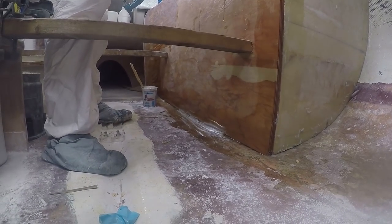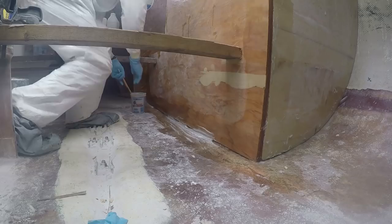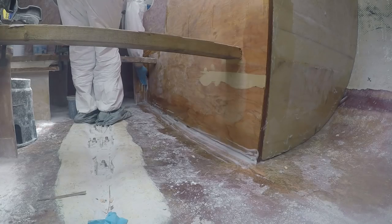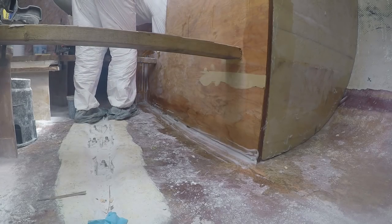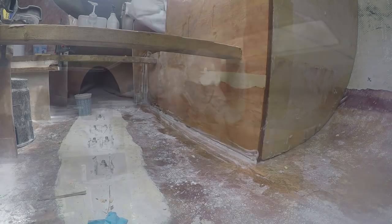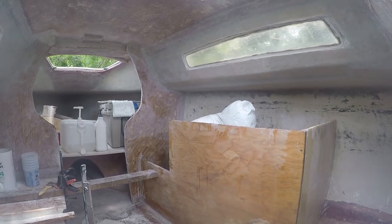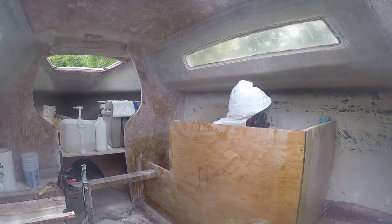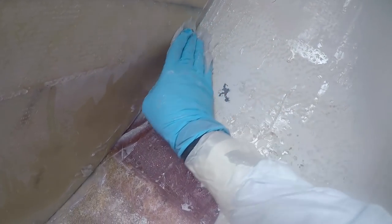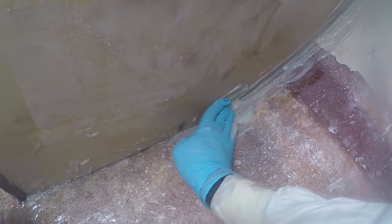The smudge is fixed — we can see again. As with all added pieces to the boat, I start with thickened epoxy and begin smudging it into the seams. The best method for smudging the epoxy into the seams is to use your hand, then follow it up with the squeegee. Using your fingers as a guide really helps to know how much epoxy you've put in the seams and exactly where it's gone.